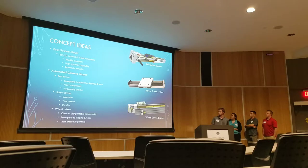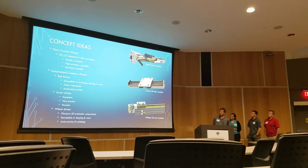Moving to the next one, there was the ball screw. The ball screw, for one, just looks really cool. And it's more accurate because as you turn the ball screw, it will move five millimeters for one turn. You can account for that as far as how many turns your motor moves. Lastly was the wheel-driven one, which could be accurate, but it's more prone to wear because you're using plastic wheels — it might be a little cheaper, but it's not going to be as durable. So all in all, we went with the ball screw. Spoiler alert.